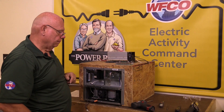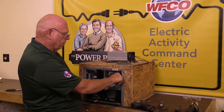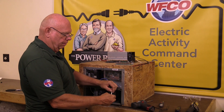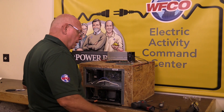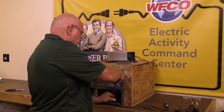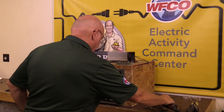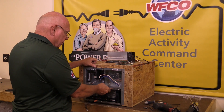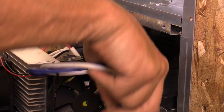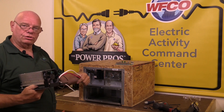For our scenario here, I'm going to leave the board up on top. Next, route the wires back down from behind the mounting bracket. Be very careful pulling and placing wires here, as they can get caught on sharp metal edges and fray or chafe. Then take our six-inch Phillips bit and remove the two mounting screws at the very bottom of the MBA board. At this point we can slide the whole unit out, routing the wires through the holes in the cabinet.